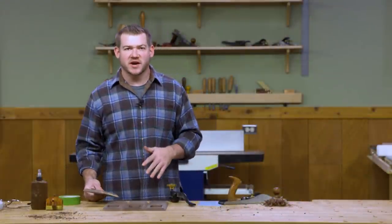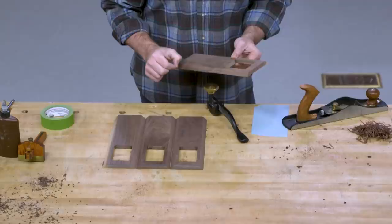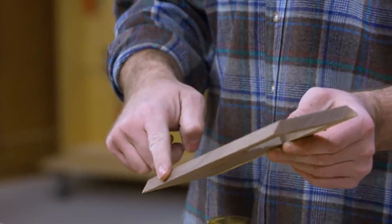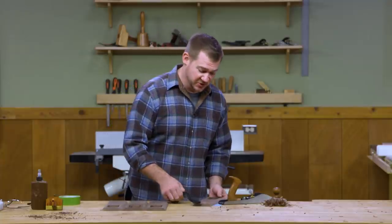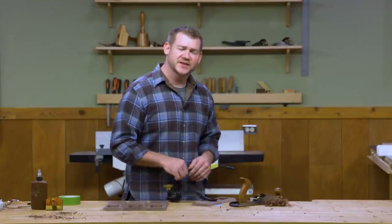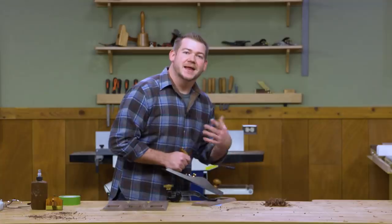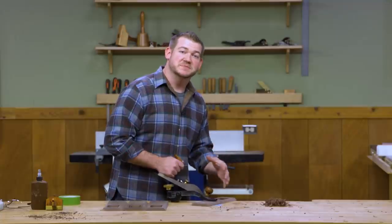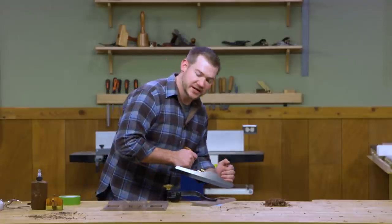The last thing to take care of before gluing this together is to cut the decorative bevel along the inside top edge of each side. You could do this at the router table with the 45-degree chamfer bit, but this is a pretty quick task with a hand plane. I've laid out the bevel on top using a marking gauge, marking the inside and top face. As I make passes with the plane, I judge progress based on where the cut is in relation to both lines — we want it even all the way down at 45 degrees. Then we'll get it glued together.